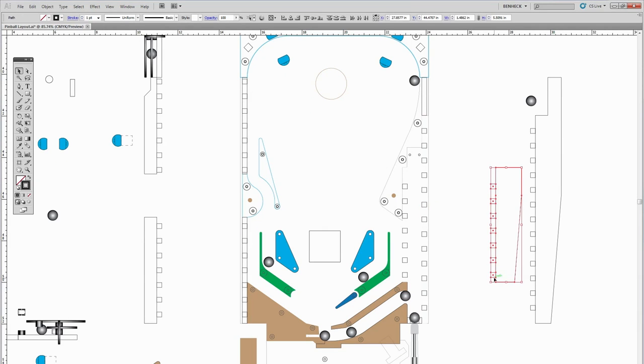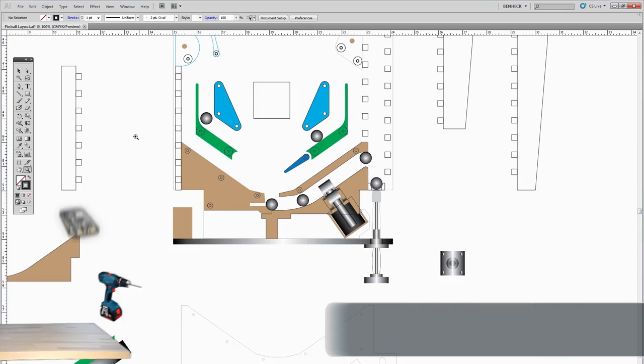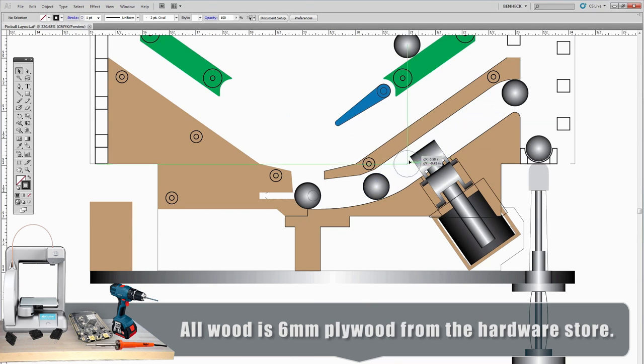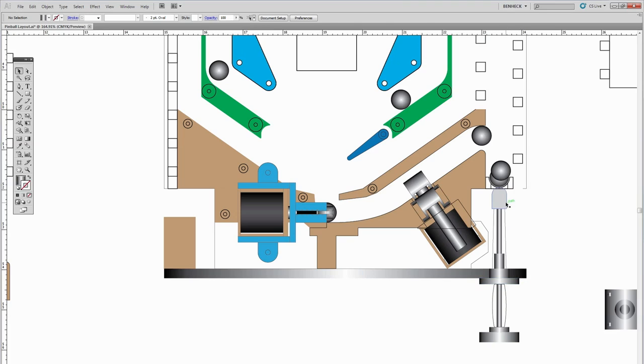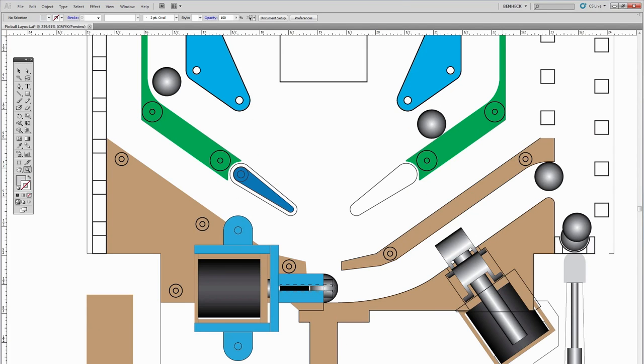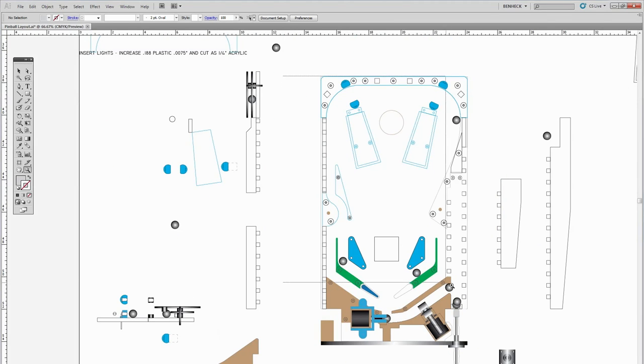There are walls with tabs that will slot into them. I'll cut the walls on the laser and then slot them in place — basically to keep the board straight and also for the ball to roll down. The load coil will go down there; this coil allows the ball to pass through. This other coil actually kicks the ball out, so what happens is this one opens up, this one kicks the ball out, and the ball goes into the shooter lane. This plunger we will 3D print and we'll use NinjaFlex, so there's kind of a rubber tip. Flipper bats will also be 3D printed. Ramps — we draw them in two dimensions but they'll also be 3D printed. None of these parts are very large, so they're okay for 3D printing.